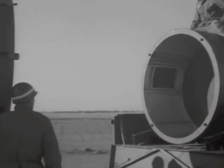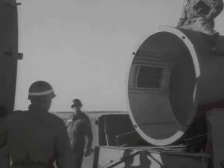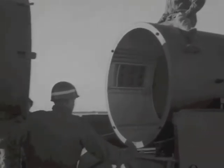The missile warhead resting on its transport trailer will now be mated to the missile aft unit containing the inertial guidance system. The aft unit is suspended by block and tackle rigging attached to the lightweight erector servicer A-frame. The two sections will be joined by the use of 8 non-destructive bolts to form the missile body.